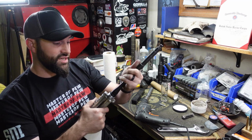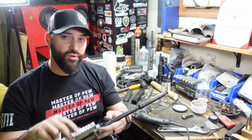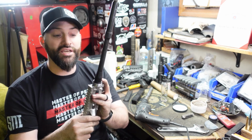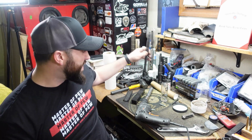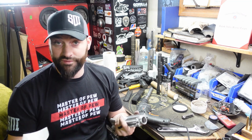So that when this guy gets locked up in there, there's not gonna be a lot of wiggle. And specifically, there's not going to be all that pressure from that mounting of the barrel. All that torque and all that pressure is not going to be coming down on one high point. It's going to be evenly spread out over the whole mating surface of that upper receiver. That's really why it's important. It just helps stuff last longer, and also really does help your accuracy.